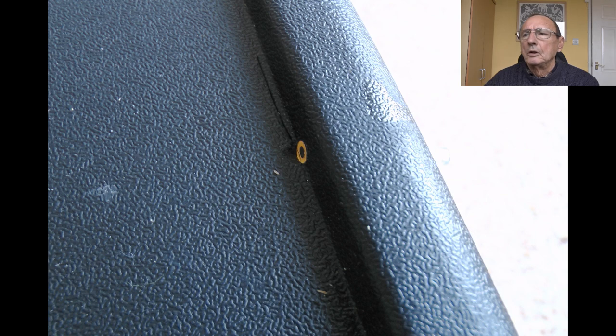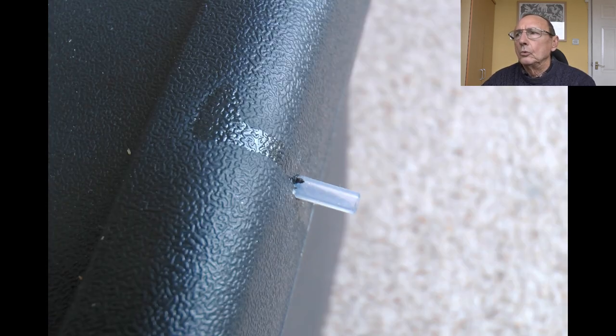I'm still going to get a puddle because of the lip, which is hollow and goes either side of the base. If I just drilled a hole, the rainwater would fall down into the tank, so I drilled holes and fitted tubes so any rainwater on top runs through those holes, out of the tubes, and down to the ground rather than diluting the nutrients. It would have been better with a flat-topped box, but never mind.